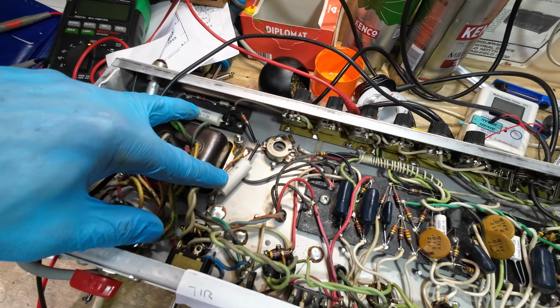We're actually getting a bit of life on the scope as well. Now I've got 120 volts running on this amp, so still not a lot. Remember, we're 240 here. We've got 176 volts there. So I'm now going to go up a bit more, so I'm going to remove one of the 40s and just put a 60 in. So we're just going to creep up so we're not straining these caps.